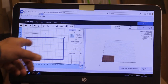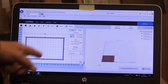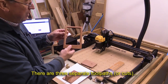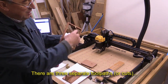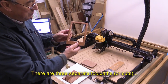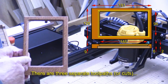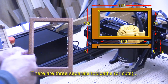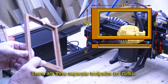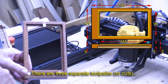You can see here that I've already made a little start with the design of the picture frame. I've said what the material size is and I've put a rectangle there showing where my first cutting path would be. And this is what you have to do. I've removed the backing and the piece of glass and it's this piece that we're talking about which is important. I'll show the dimensions on the screen now. This internal dimension here is perfect for a 6 inch by 4 inch photograph. On the reverse the rebate cut is more than adequate to take a backing piece and the piece of glass.